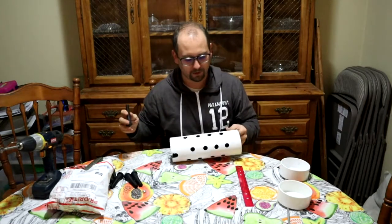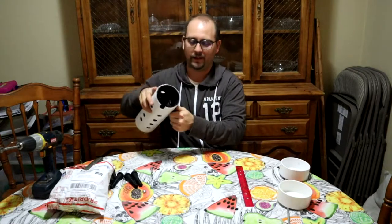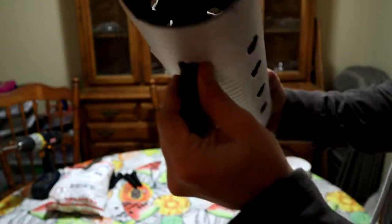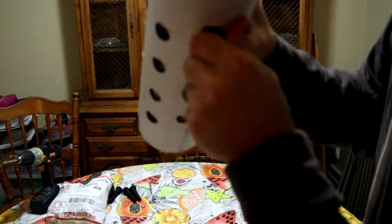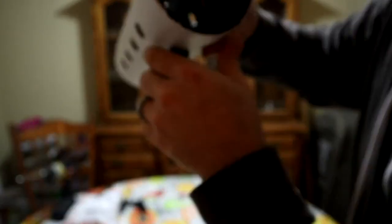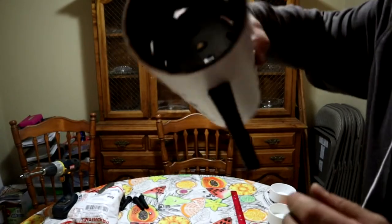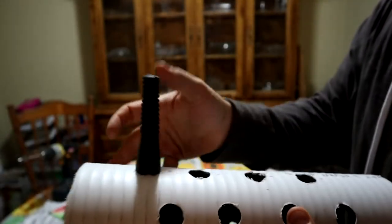You're going to take these fingers and slide them in — and it is not going to fit. That's important; you don't want it to just slide in. You're going to have to yank them in. As you can see it does not fit, not even close at first. It's still got about an inch to go. We're going to force it into the channel — it'll take a little hand muscle, but you'll know when you get there because it won't go any further and you'll feel that channel kind of get accepted by the plastic. You can see just the rubber nub is on the inside, and on the outside you can't even see the channel — it's in there, stuck for good.